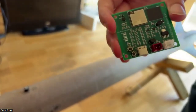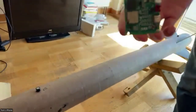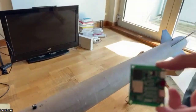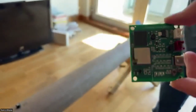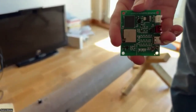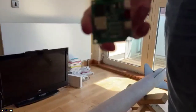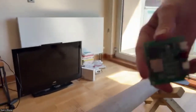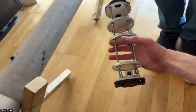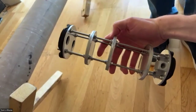It will be doing 3 primary measurements. It will be recording the temperature within the payload bay, and we're also recording temperature within the avionics bay, so that'll be a nice way to tell the difference in temperature along the airframe between the central coupling point and within the upper airframe. It's also measuring the spin rate during parachute deployment and descent, and vibrational analysis using a strain gauge mounted within the payload support structure, which will effectively tell us what sort of vibrations are happening in the aircraft and any way that we could potentially reduce that in future years.